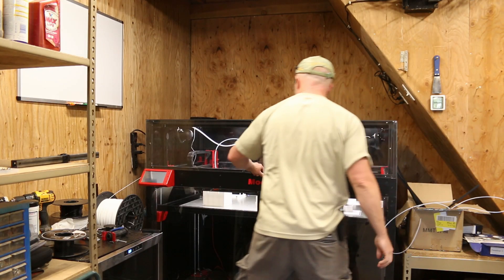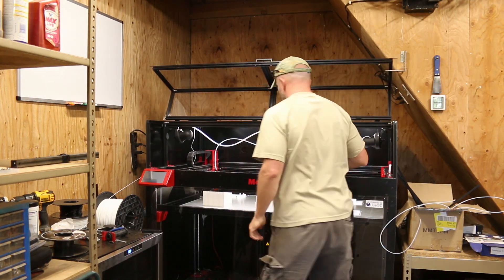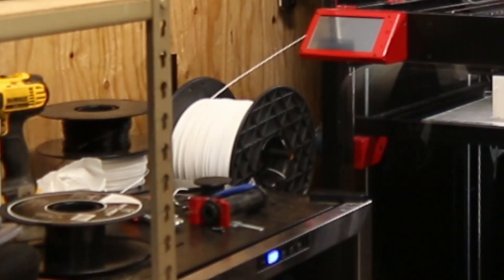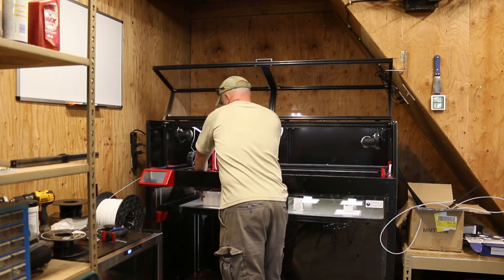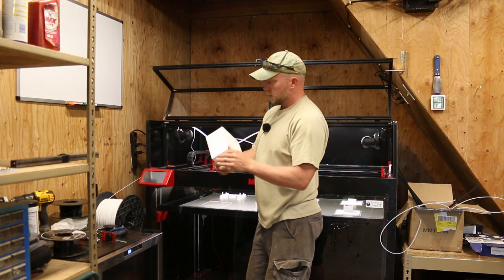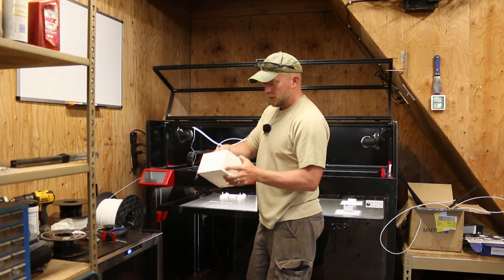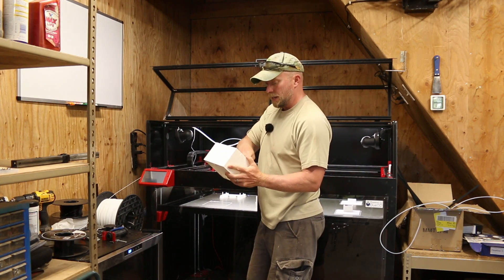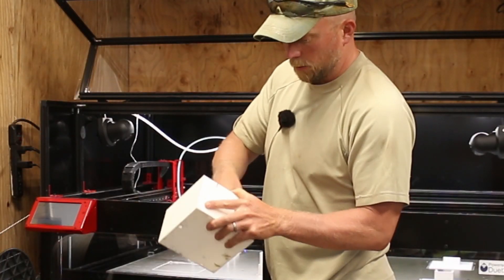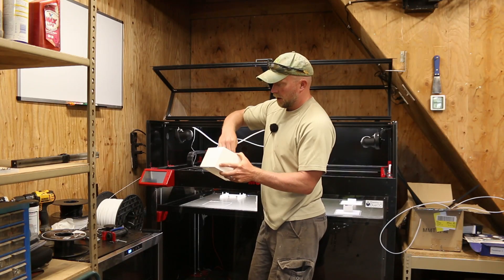Happy Monday, Mission Control. I gave up on using the black filament — it's just not worth my time. I switched over to the white; I got it on the eight kilogram roll and set the print. This is the first set off of it and I can already see I didn't update the settings from the black back to the white, because we have a higher temperature being used for the black than what we need for the white. So I do have some oozing here, but nothing that's bad.